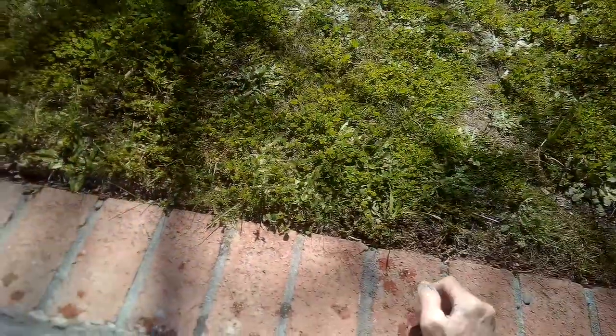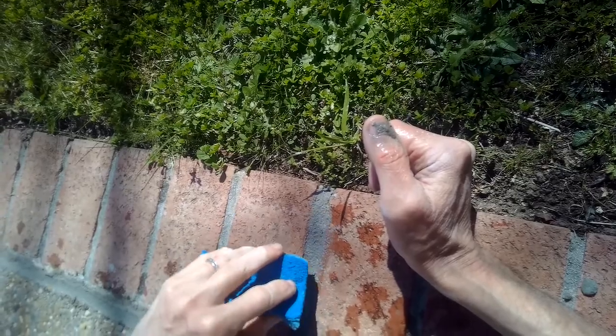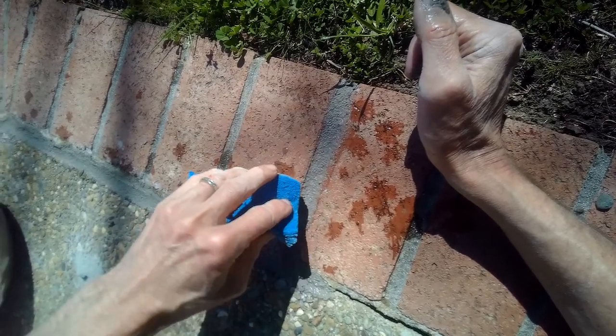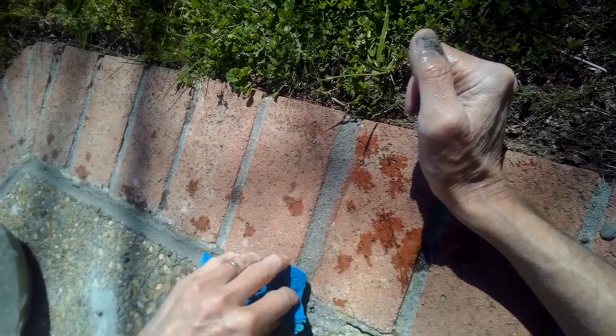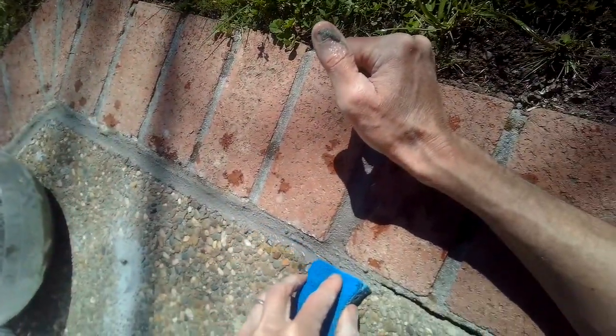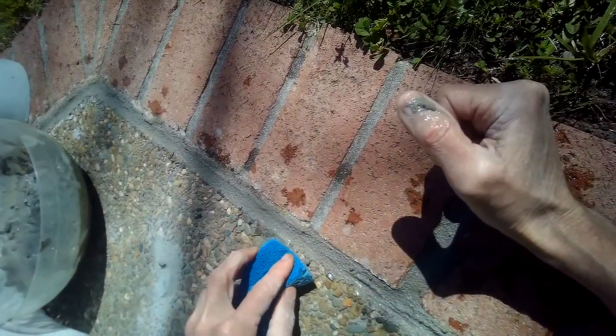If we look at the original work, a professional can put this stuff down easily and smoothly — that's our goal. Water helps us in that regard; we can use it like we use water in painting to smooth material out. Get the sponge wet and lightly go over the area you just repaired. The good thing about this mortar is when it dries it'll change color a little bit — end up lighter — but I think it's going to be a really good match, and it'll be hard to tell where the repair was done.